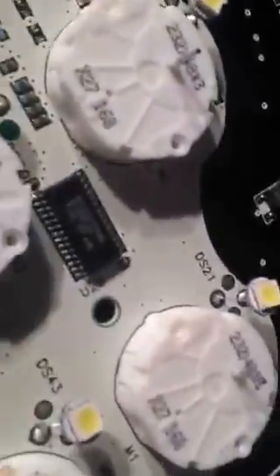When you take these out — what I did was I flowed out and sucked up the solder with the desoldering braid. Just real gently — only do three seconds on the board at a time. Don't get crazy with that, you can hurt the unit. There are these little tabs, and after I sucked the solder out you'll see the well get dry around where the lead goes through the board. Then just take the tip of the soldering iron and flick it and it'll break loose. Be careful not to touch anything else when you do that. You definitely want to get a magnifying glass to do your work, especially when you start off.